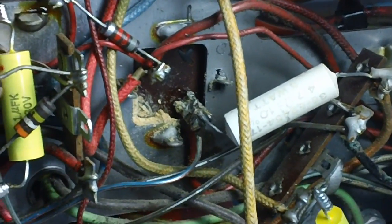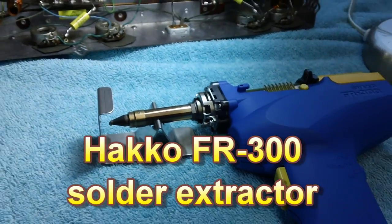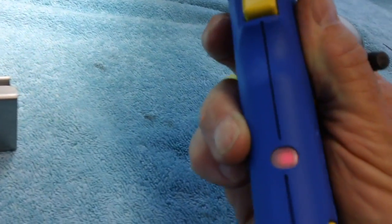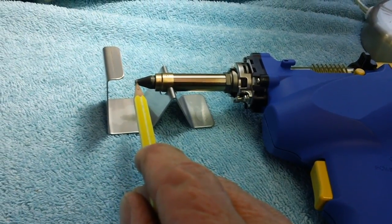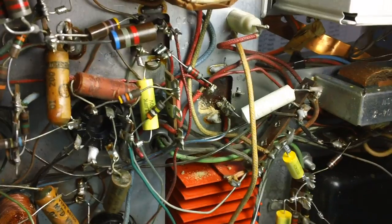I don't think I want to do that. I'm going to try out my brand new Hakko FR300. I've already turned it on - the switch is back here on the handle. When you turn it on you press it in, then you get a little red light down here at the bottom. You apply a little dab of solder to the end of it, just like any other soldering iron - you want to keep your iron wet. Then I'm going to try to suck off the solder from these contacts.